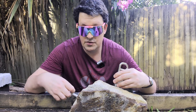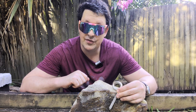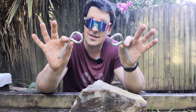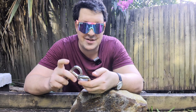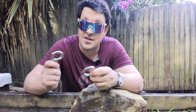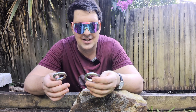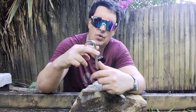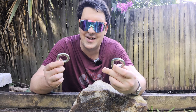The plan is two bolts in this rock. I'm going to install them sub-optimally — not recessed, poking out fully. That is not what the manufacturer recommends. These are Lapis, and Lapis does recommend you recess them, but I know a lot of people don't recess them, and a lot of manufacturers don't recommend it either. So I'm going to do what I consider a substandard installation, because frankly, if these are actually recessed properly, I can't see that rotating at all. This is more a test of basically the worst installation I can think of.